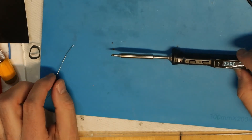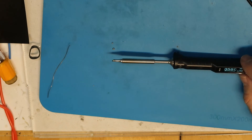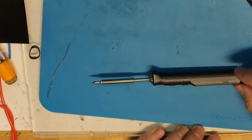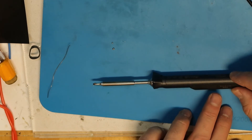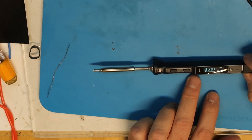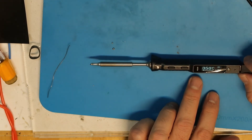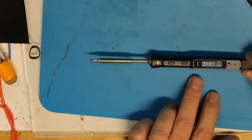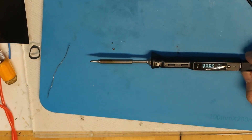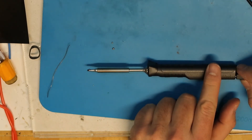Overall it looks like it's working pretty well. I don't have a PCB to demonstrate soldering right now, but I'm familiar with this type of iron — the company is MiniWare and it works well. This is basically portable: if you use a power bank that supports Type-C QC, it will automatically negotiate to 20 volts, so you can work with a USB Type-C QC3 power bank or any compatible power supply.